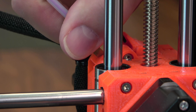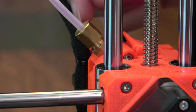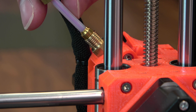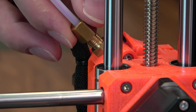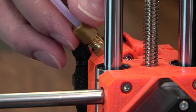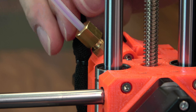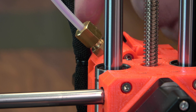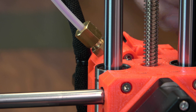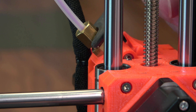These are traditional brass fittings that you would see on things like water lines. If you take the top collar off, you'll notice around the PTFE tube, you'll have this compression brass bead. So when you put the collar back on, it compresses that bead and keeps a really tight hold on the PTFE without distorting it. Compared to push couplers, that is a real bonus for the Prusa Mini — you won't have any issues with the PTFE pulling itself out.